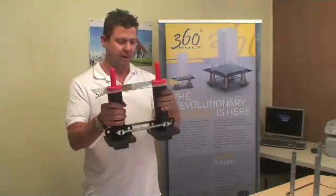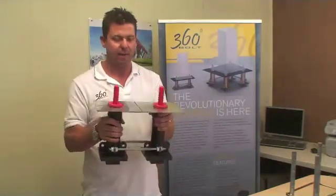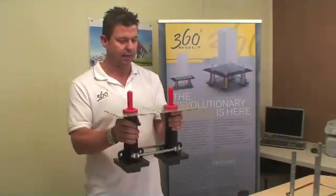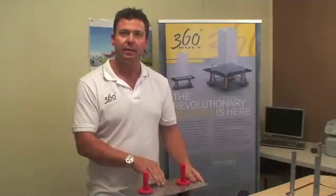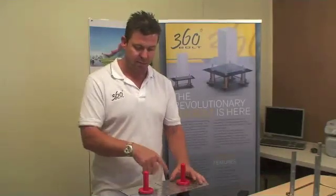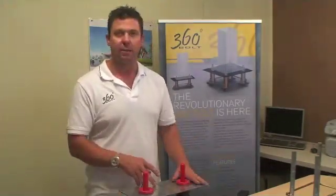There is no welding at all on our product. Therefore, you don't need a welder on site, there's no rust coming out of the product or interfering with the foundation. We also have a galvanized plate on top with survey markings so that when a surveyor puts his pins down, string lines, or whatever you're doing on site, you can locate this product correctly.